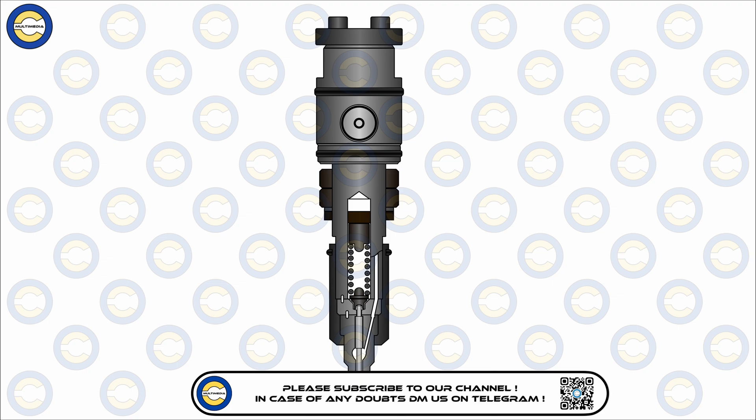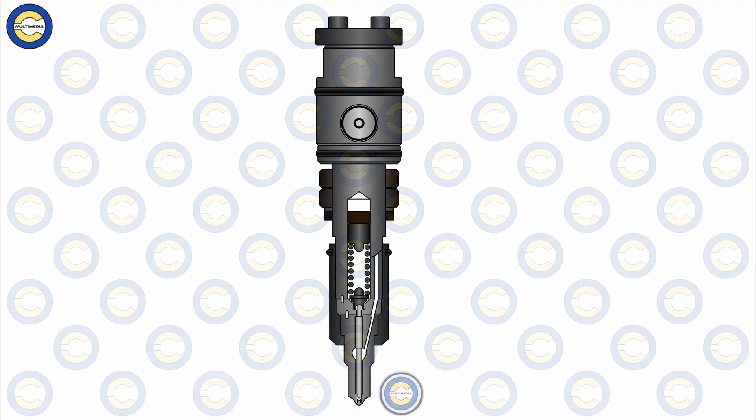The fuel coming into the system with the help of supply and circulating pumps is delivered at high pressure by the fuel pump through the fuel lines of the generator into the injector body. This fuel then enters peripherally and surrounds the needle inside the injector, passing through the area surrounding the needle. It then awaits on the surface of the needle across which it is seated. At this point the needle is held tightly against the nozzle by spring force, so the needle is initially closed.